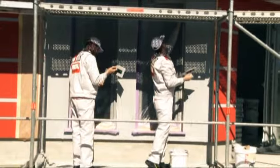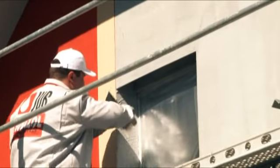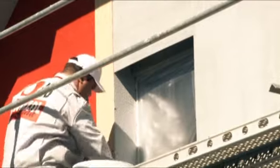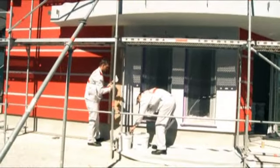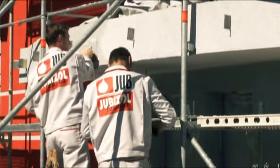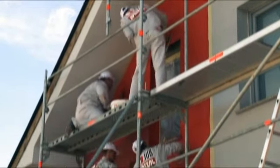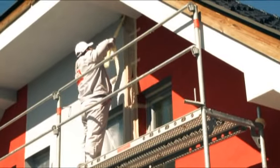It is very important to properly protect the surfaces of windows, doors, etc. If done upon completing the painting works, no additional work is required in order to clean the building. This is especially true for works with materials of a silicate basis, where chemical adhesion to the surface occurs. In this event, such stains are usually very hard to remove.